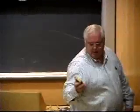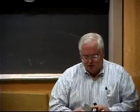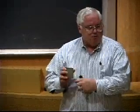This is a piece of stainless steel. It's plasma cut. We'll talk about plasma cutting. I guess you saw it if you went to the lab tour. This is a little bit heavier piece than we were cutting in the lab. If you look at this, you'll see it's not quite square as you go around the corners. And the problem is I have heat flow here, and then I turn the corner, and I don't get symmetry around that corner, and that creates some problems.